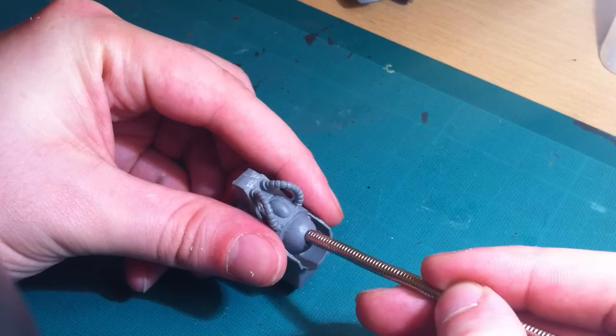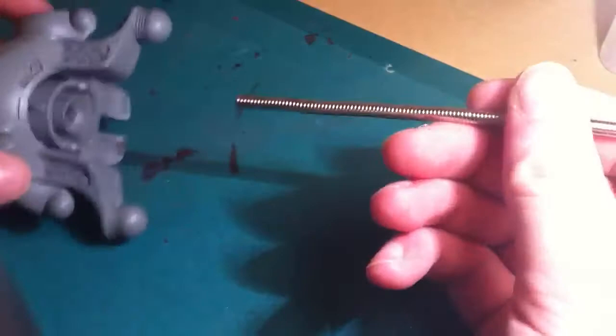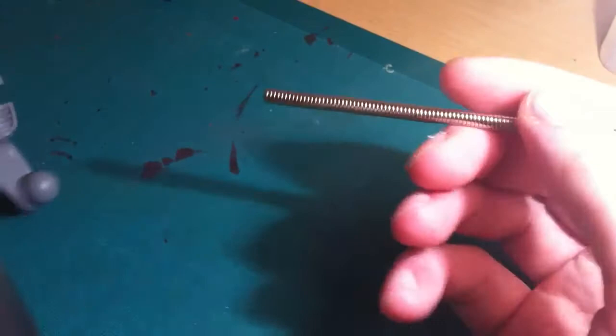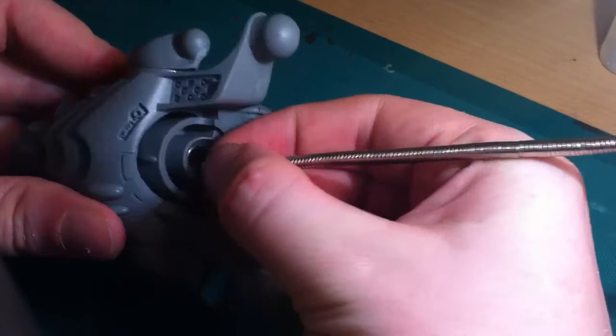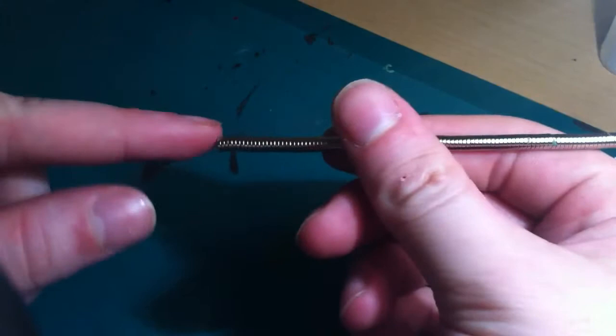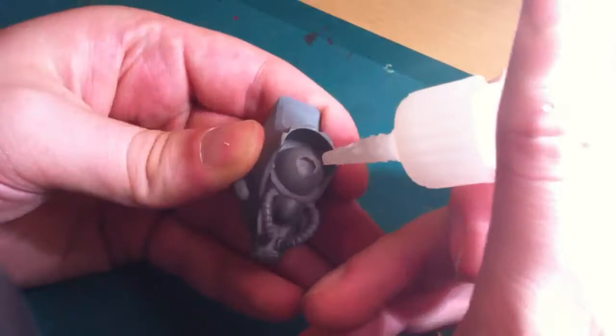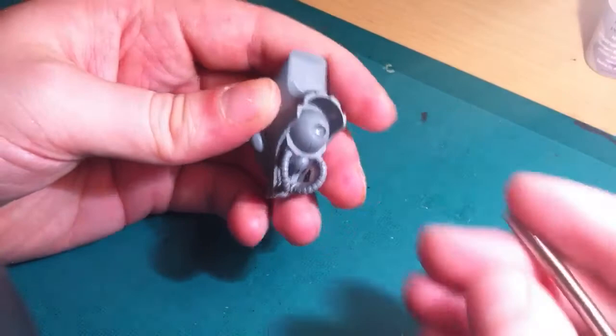Now is the trick where we find out which way these magnets need to go in. They're all facing in the same direction because they're all attracted to each other. Let's assume positive is this side and negative is this side — that's true for all of them. So that's the side which attracts — that's the side we don't want to glue into the head, because that's the bit that attracts to the other magnet. It's the other side we want to glue into the join. Take a bit of glue, put it in the join, and slide the magnet in.